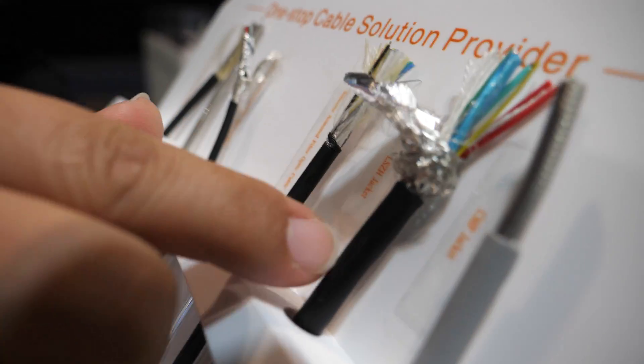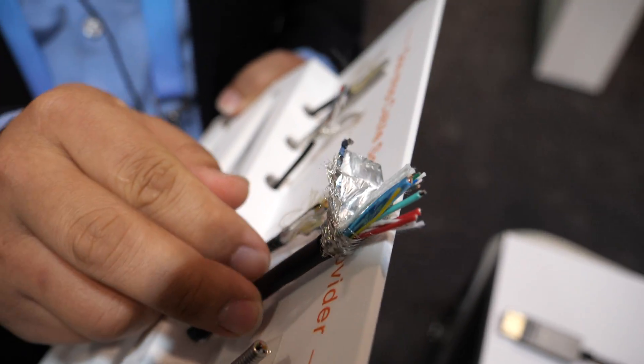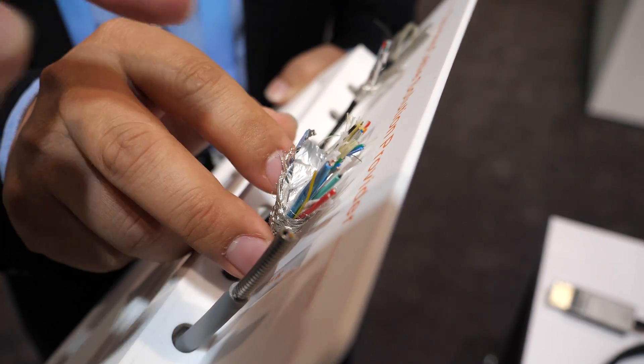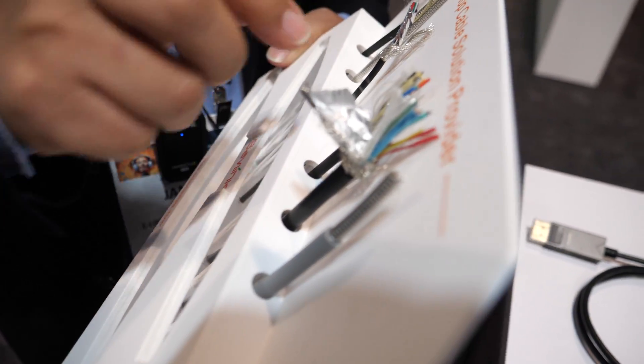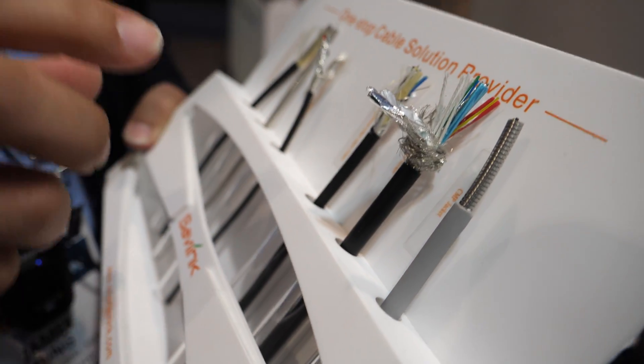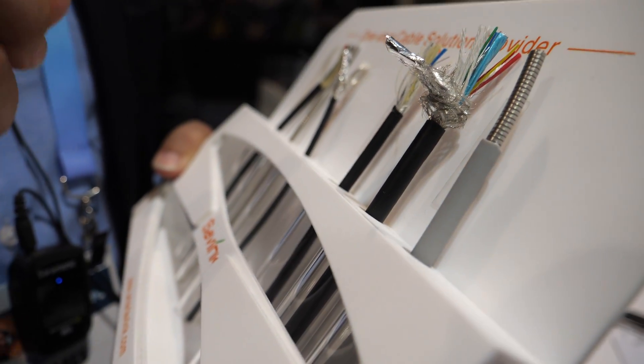What is the other cable we see here? It also uses USB-C. You can see this cable is very strong — it's used for some medical devices and it has a shield. The shielding is helpful for EMI interference, because for some medical applications it needs EMI and EFT testing, so the shielding helps with that.